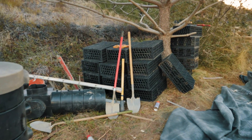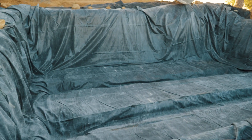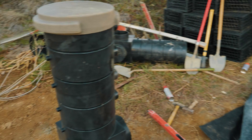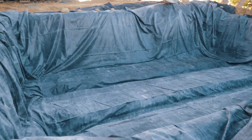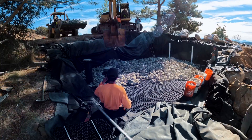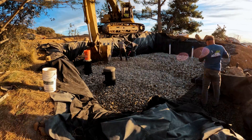We worked into the dark last night getting this liner installed. We will be installing a layer of aqua blocks on top of that, which will basically create a sediment chamber. It's gonna allow solids to settle out inside that lower section to be removed through the snorkel vault once we do a clean-out. We can put a clean-out pump inside the snorkel vault, wash everything down, and eject any of that dirty water. On top of the aqua blocks we've got layers of rock and gravel — starting with a four to six inch cobble, followed by two to three inch, and then finally a layer of three-quarter to one-inch river gravel.